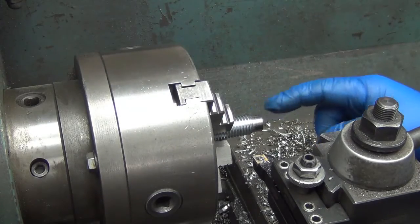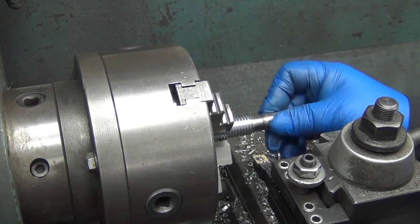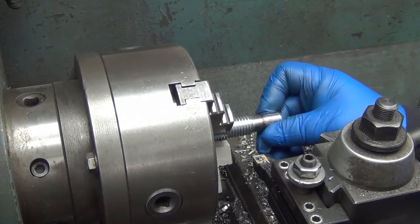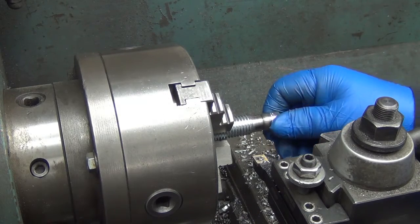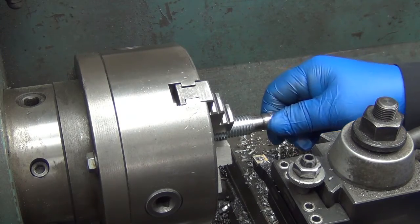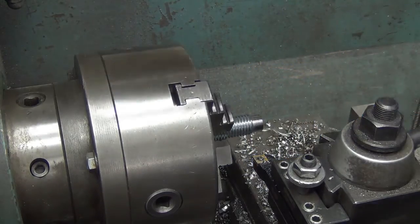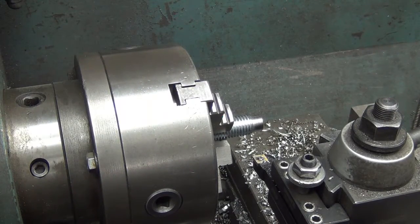Alright, now I didn't use any oil when doing the drilling because I was too tempted to clean it off with brake cleaner, and you absolutely do not want to use brake cleaner if you're going to be doing any welding with argon gas. So I made sure the hole's drilled deep enough, then I used the countersink to put a little bevel there to help that set in even a little bit more. So you push that in hard, and there's no wiggle, and this should just go right on. That's a good thing about having the bevel too. I shouldn't have to grind a whole lot of weld off. If I was a good welder, that's probably the case. We'll see what the reality is when I do it.